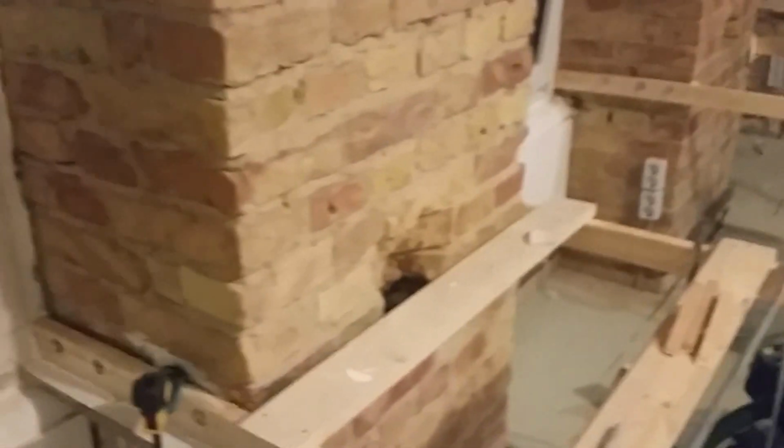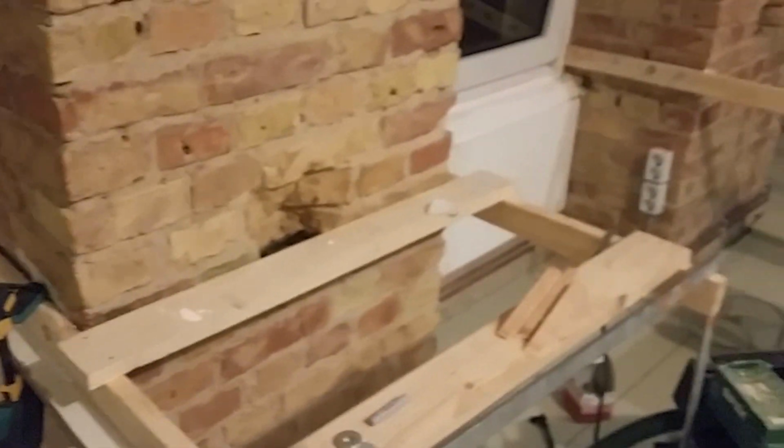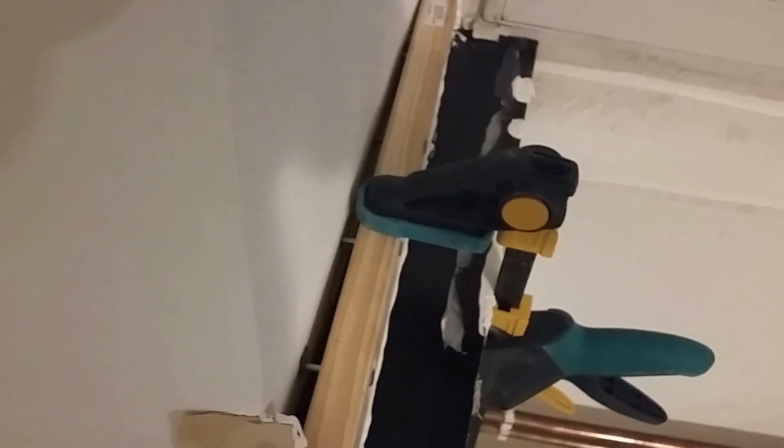because this building was built in the late 1800s, I think 1890 or something, and none of the walls are parallel or perpendicular where you would think they are. And this is why we went all out and did all this crazy alignment job here, so that they're all parallel and perpendicular to the planes they're supposed to be. And we will fill these gaps here that were created after lining them up, so that they're parallel and perpendicular.